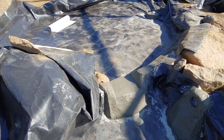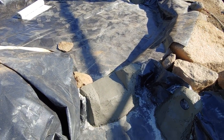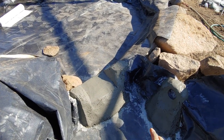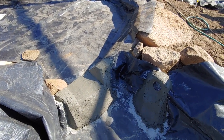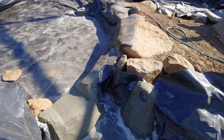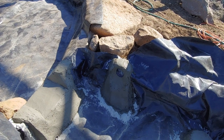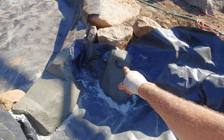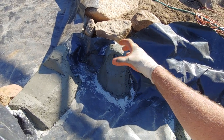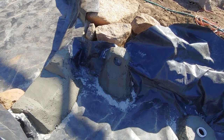We have a little bridge space here — this is actually going to be one big pond, these two. I was thinking about doing a spillway into this one, but the elevation issue just got too funky. So these two ponds are going to be basically one water body. The overflow point is a four-inch ABS black pipe that's been put right there, wrapped around with tie wires, pulled tight, and silicone sealed all around to glue it in tight and waterproof it.